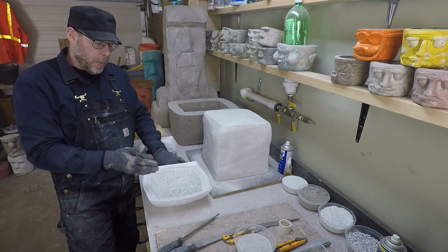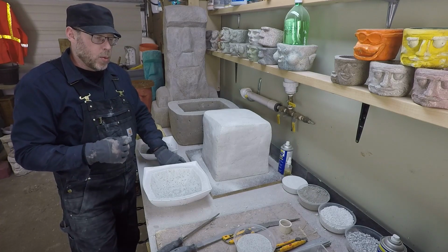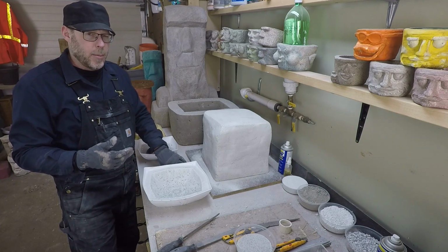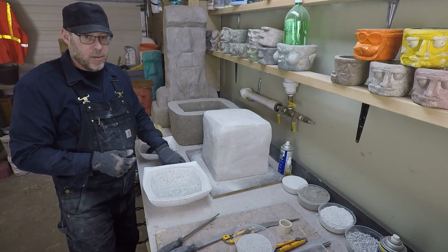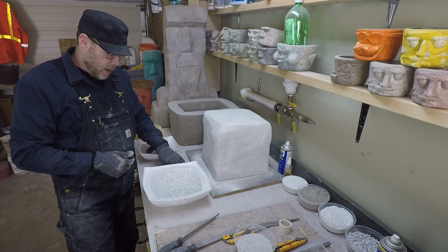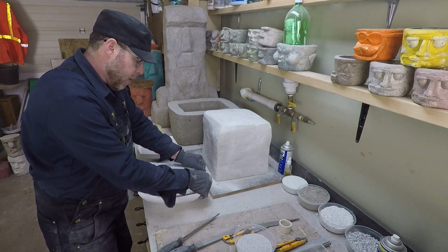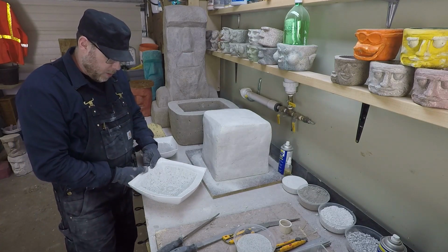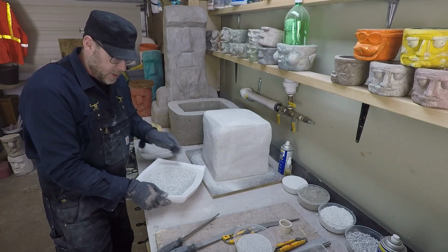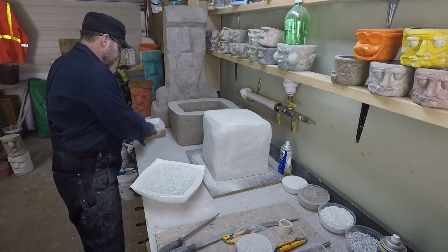And I would use 1 part white sand, 1 part white cement, mixed with water to a wet cake batter-like consistency. And then I would just paste that in, with a paintbrush even being pretty much ideal. And that would help to get that inside finish looking a little better. Now I'm hopeful that the outside looks a little bit better than that, because that's what I'm worried about, the outside, because that's what's going to be visible. Should be able to just get this out of here.